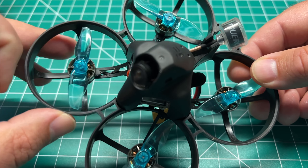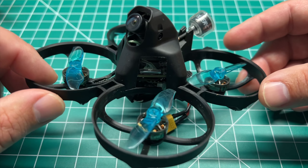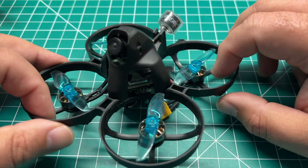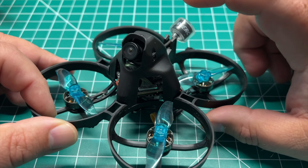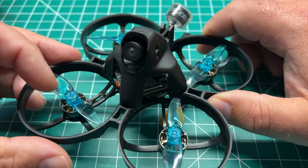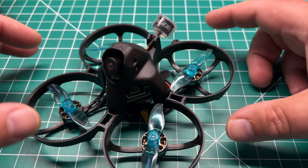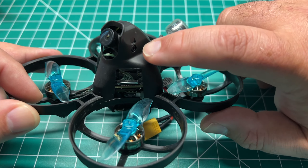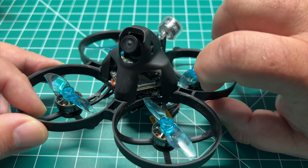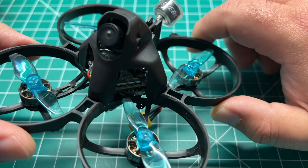I went with bi-blade props to improve flight time. I'm getting about two minutes on one of those 2S 300 HVs charged to high volt. You could shave some weight with the canopy — that's the main change I would potentially make. You could use an on-board SPI ExpressLRS board, though I know they may not be supporting that with 3.0 and above. Darwin FPV does have a board with on-board ExpressLRS — I believe it's $10 more. So you're paying $39.99 for the board without a receiver, and the SPI ExpressLRS version is $49.99.